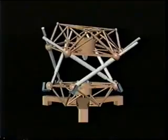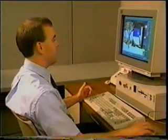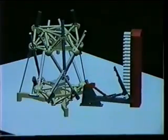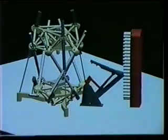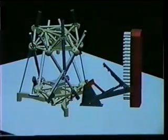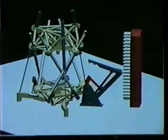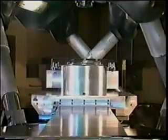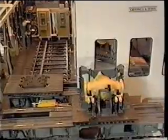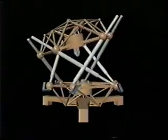A space frame platform gives the structure rigidity without adding mass. The structure was optimized through extensive finite element analysis. The Variax Machining Center's unique structure requires an equally innovative tool exchange mechanism. Giddings and Lewis engineers designed a tool change arm based on a four-bar linkage. The tool change arm is kinematically locked to the correct tool delivery path. This uncomplicated mechanism has minimal parts, making it a highly reliable device. One of the Variax design objectives was easy integration with standard peripheral equipment. A conventional, commercially available mechanism is used for tool storage. A conventional 630mm machining center pallet interfaces to standard pallet transports, allowing seamless integration into a manufacturing cell or system.